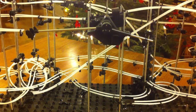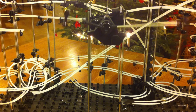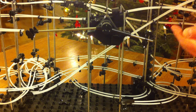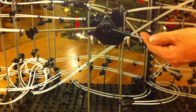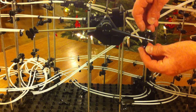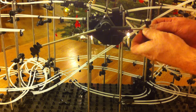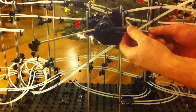For the rotating boom there are two things to adjust: the position of the scoop picking up the ball at the top and the scoop picking up the ball down here. The second thing is the rotation itself, so that the boom comes back nicely to its original position. For that there is a counterweight that can be moved towards the center of rotation with little effort, like that.